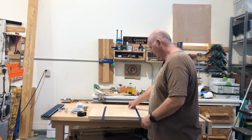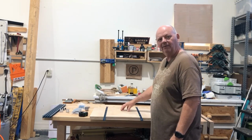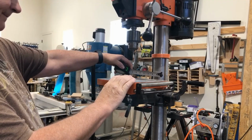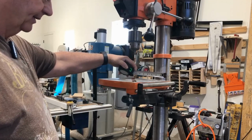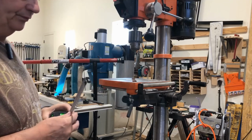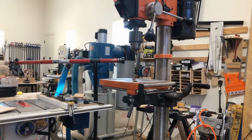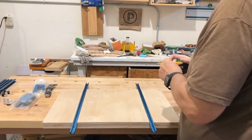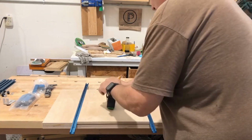So here's the centerpiece cut. Before gluing it down, I want to know where I might put the little insert that is removable and can be replaced. I'm going to cut the notch for the posts of the drill press. The width of the posts is about 2.5, but with the other piece is about 3. And depth-wise, you go about 2.5 inches, which should be plenty for these guys, which are just 2 1/8. So here we'll mark the center. This is 24, should be 12. I set 2.5 inches out.